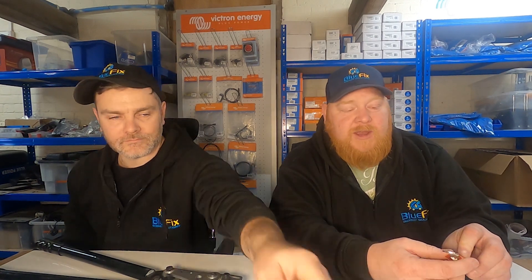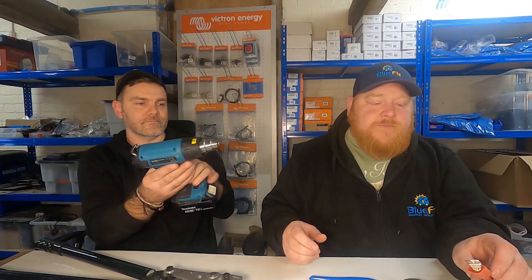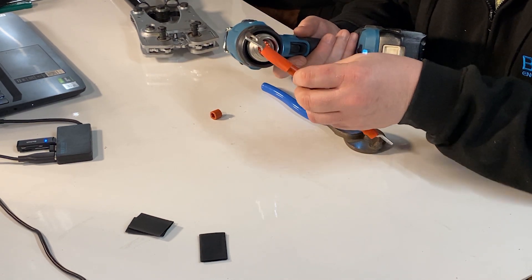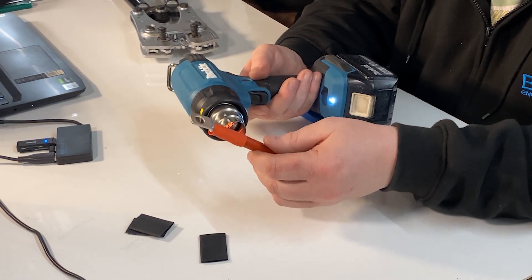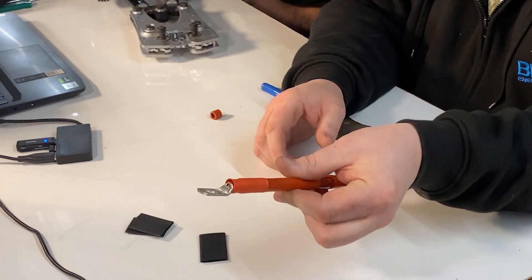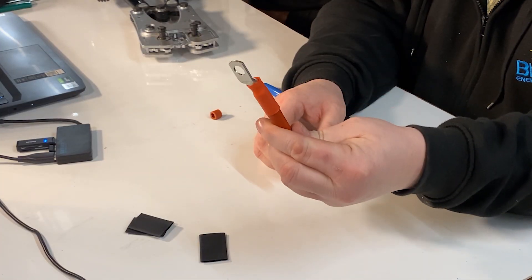What you're really interested in doing is covering this joint here - give it some mechanical protection and just make it look good. Make sure any cable strands that may have frayed don't pop out, and if they do the heat shrink will hold them in and keep it nice and tight. So it gives it structural rigidity, keeps it tidy and neat. And now we just heat it up. And there we have it - one heat-shrunk cable, nice and neat.